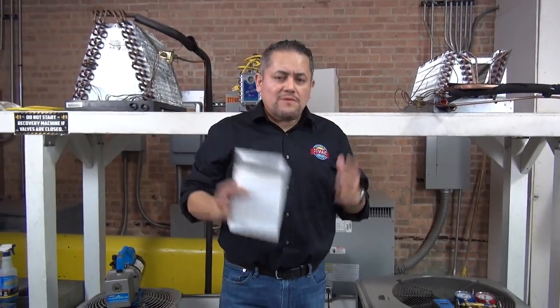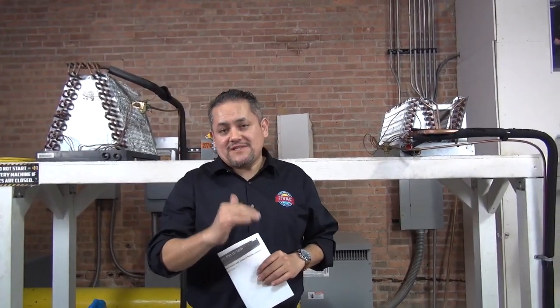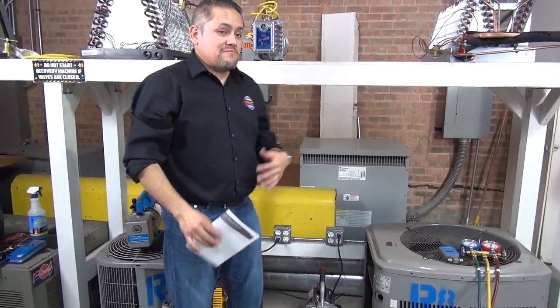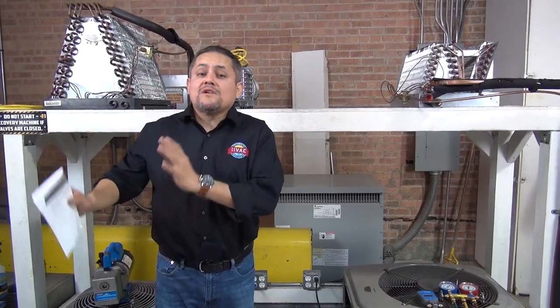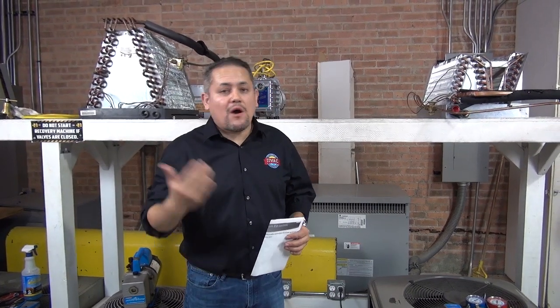Now, the evacuation theory. The pressure we have right now is 14.7 PSIA — 'A' refers to absolute pressure. We need to get lower than 14.7 PSIA. In order to lower this pressure, we use what's called the vacuum pump. Now, 14.7 PSIA is not what we use normally — what we use is 0 PSIG, where 'G' stands for gauge. So 14.7 PSIA equals 0.0 PSIG. They make it this way so it's easier when doing the vacuum or checking pressure, so we don't have to add numbers up or down.